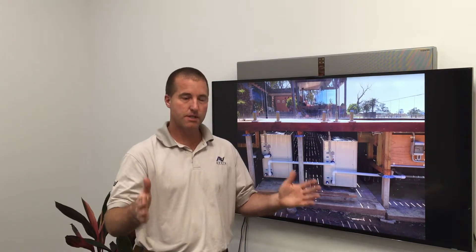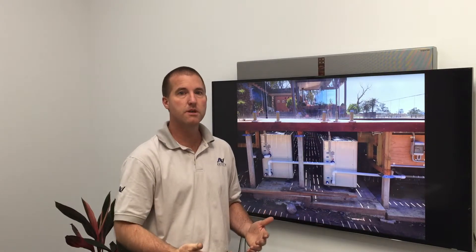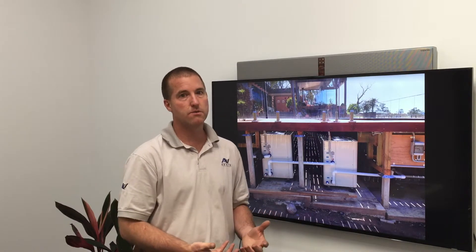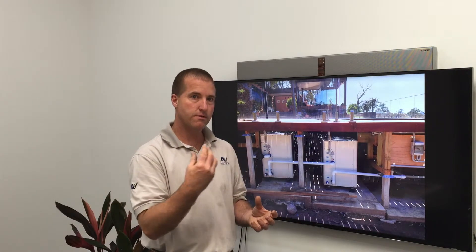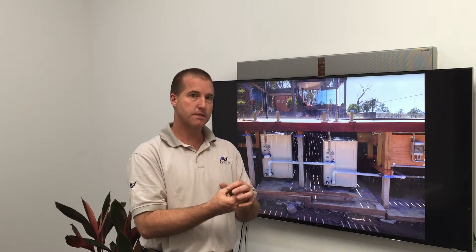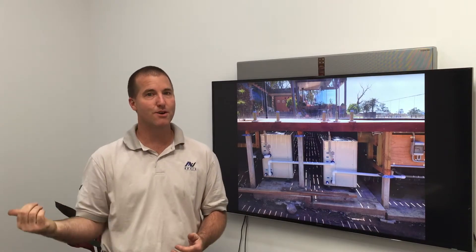The same thing happens in a refrigerator. If you feel the sides of the newer refrigerators or the back of the older ones, the back gets quite hot and inside the refrigerator is cold. We're basically running a refrigerant inside the fridge — it expands to a gas, absorbs heat, and keeps the food cold. We take it outside, compress it, and it becomes hot; then we run it through a radiator out the back and waste the heat off. So that's waste heat — in the pool case it's waste cool. That's just a heat pump in action.